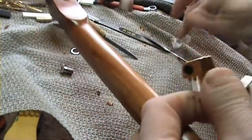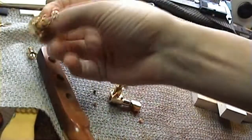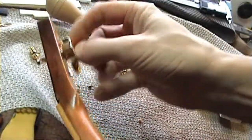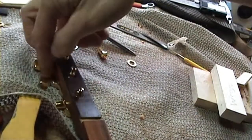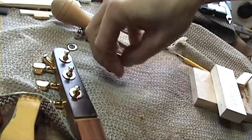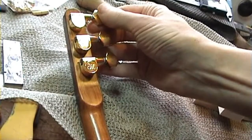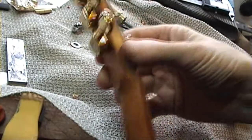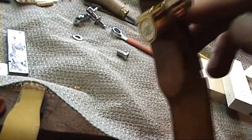Because I'm using a different make — the Wilkinson Brown — which has two pins, I'll put them on first and then loosely tighten up the retaining nuts. This is just the first fit, I'll make sure these are around the right way. When you've decided that's the position you want, tighten up a little bit more, and you can see from the side where the pins will be going into the wood. If you tighten this up a little bit more, it will press and leave a mark, and those marks are the ones we're going to use to enlarge.